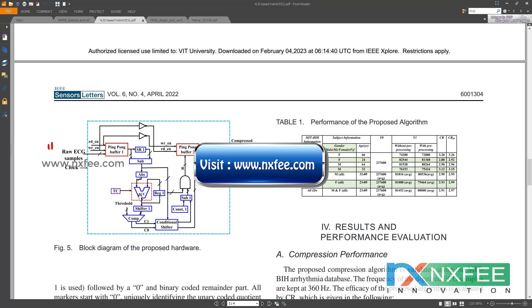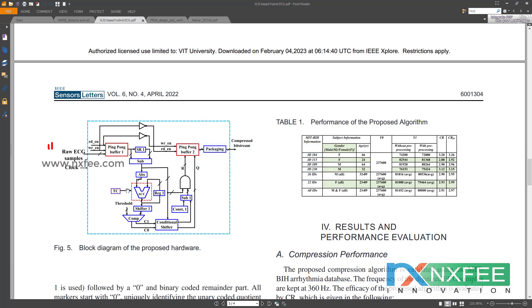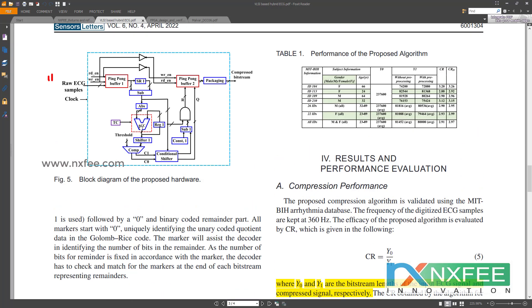After subtraction, the data goes to an absolute value (ABS) block, whose output is given to an accumulator. A terminal counter generates a pulse to the accumulator for every eight samples — adding eight values through the accumulator. A register feeds back the previous value, counting as count = count + 1 or data_range = data_range + 1. After sampling eight values, the accumulated output is given to a shift register. A configured threshold then compares this value and provides a two-bit configuration of c0 and c1.